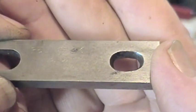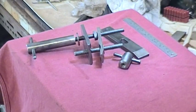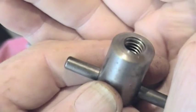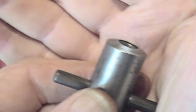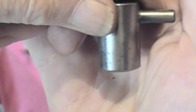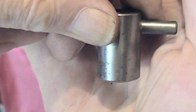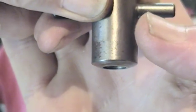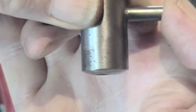One other little bit — I forgot earlier. The tightening T-piece — you'll probably see that it's got an almost chamfer radius on it. That's because if the bar is tipped down or at an angle, this bears on a washer, and that relief there allows for a central pressure.